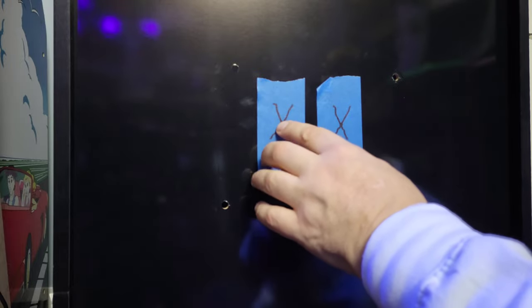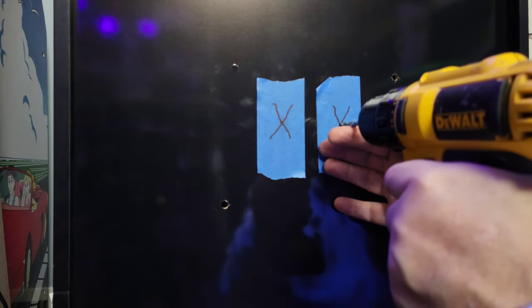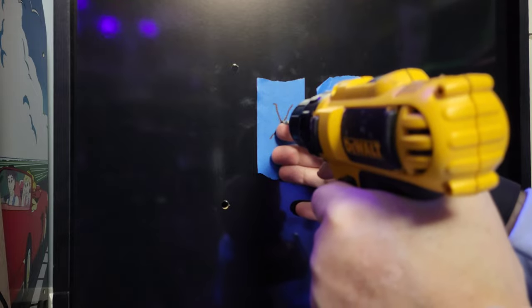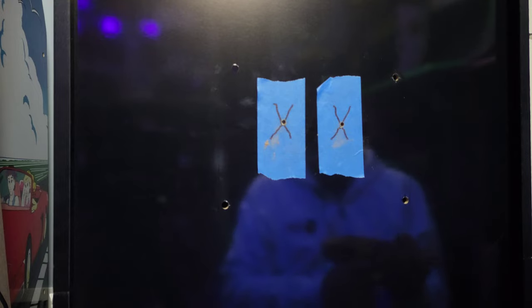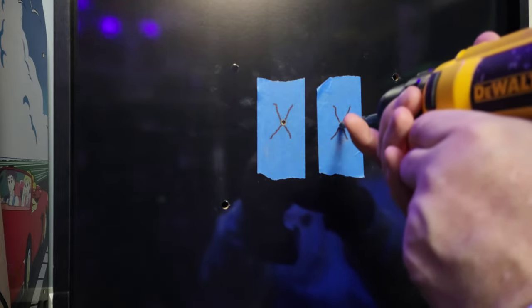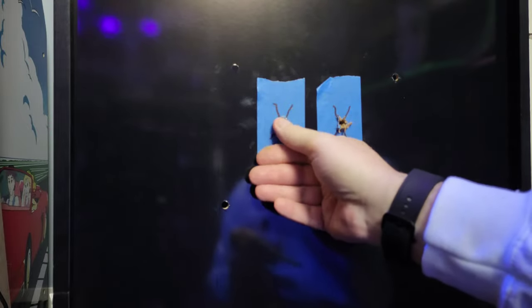Right in the center of your X's is where the center of your holes are going to be drilled. I'm going to start off with a smaller drill bit to make a little pilot hole so my larger bit doesn't slide. Then I'll go up to a 5/16ths — this might be a little tight, but I'd rather err on the side of caution going smaller since I can always make it bigger but can't do the reverse.